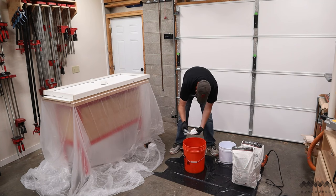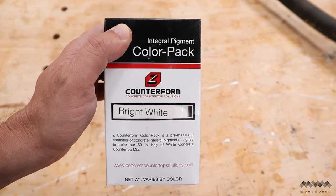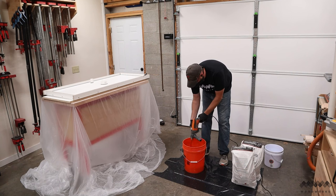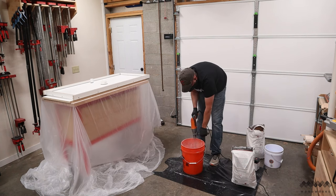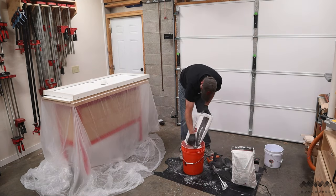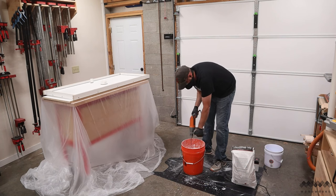With my setup ready to go, it's finally time to make the donuts. The first thing I do is add this suspicious-looking baggie of white powder — just the bright white pigment that came with the white concrete to give it that extra pop of clean, bright white. I then add all my water and give it a whirl to get everything wet, then begin adding concrete to the mix about one-third of a bag at a time, making sure to mix it thoroughly before adding the next third. If you try to mix the entire bag all at once, it'll be immensely hard to mix and you risk leaving clumps of dry concrete in the mix, which will weaken the final product.